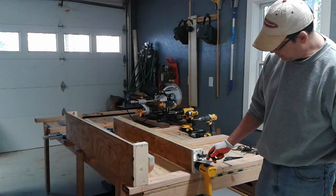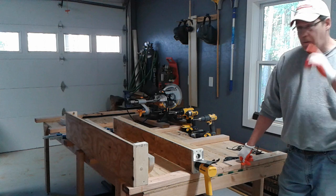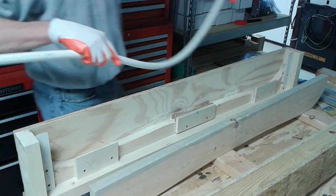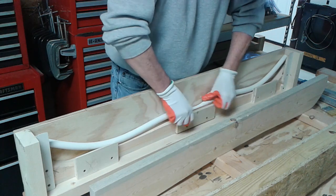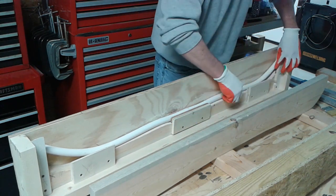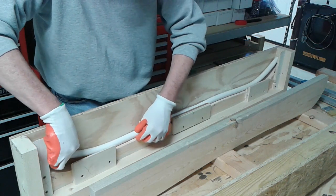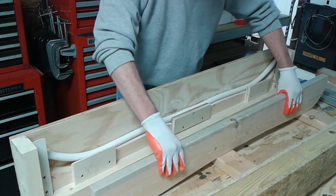I really don't need to be this particular about it, but better to have it plenty hot than too cool. All right, pipe comes out, find our center point, and I squeeze it a little bit, put it down in there where the handle is, line this up. We've got to make sure we're straight here. We've got a few seconds we can work with this. We don't have long, but maybe 45 seconds or so. Everything looks good and straight.